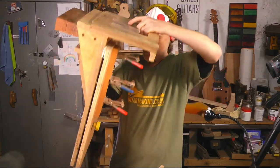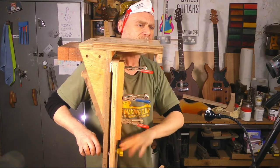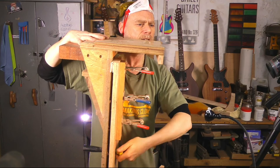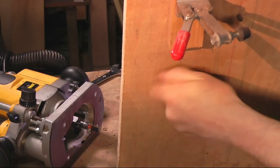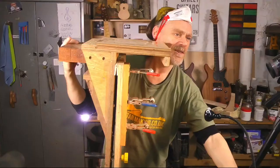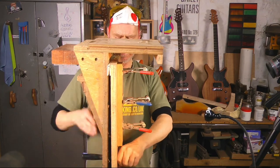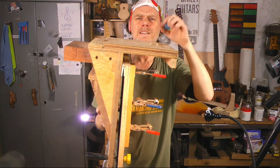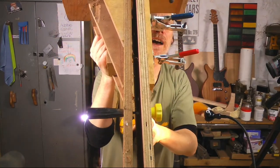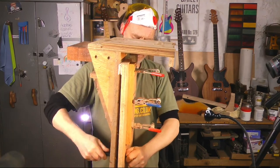So there's that part, but then the really important part is the way you can angle this jig. It's basically a handle on this side and a handle on this side, threaded rod through the middle, and that enables you to adjust. Can you see the angle changing? Turning the screw. It's there somewhere, Carol. And then I can lock it down, you see. There's a locking nut in there, one of those nuts with the plastic bits inside. You might not be able to see. And then a handle on each side, and that enables you to adjust this to different angles. Simple as that.